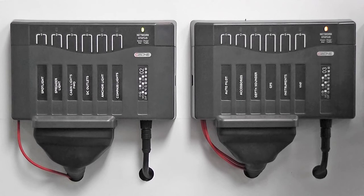In the unlikely event that a circuit cannot be controlled by the C-Zone system, an override feature provides the user with the ability to bypass the C-Zone system and manually control the circuit. To access the bypass feature, locate the output module which the circuit is controlled by. The circuit can be identified by a label on the lid of the box — in this example the user is going to bypass the cabin lights forward circuit.